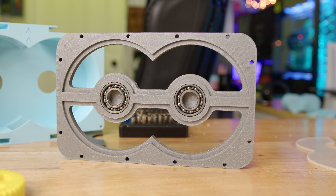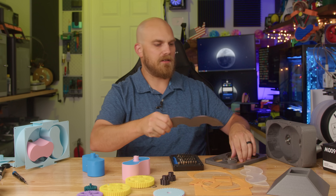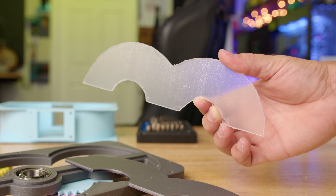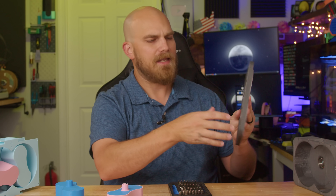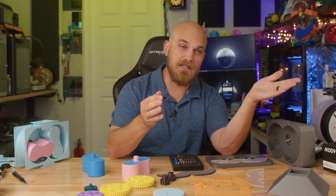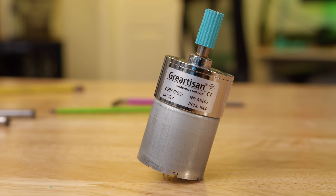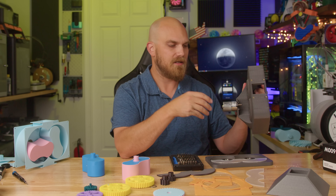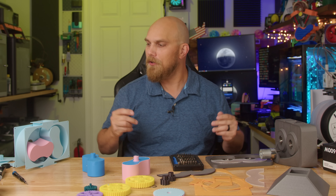First change is on the front cover — I added windows. The windows have no purpose other than, well, you know why we put windows. To make them, I drew them up, made a template, traced it onto some one-eighth inch acrylic, and just used a Dremel to cut it out. The edges are pretty rough, but they're going to snap onto the inside and they've got a border to make it look cleaner. We'll probably use some hot glue around the edges to seal it up. We also needed to tackle the power plant since the A12X25 was out. I have the T30, which is a little stronger, but PC fans aren't really known for their torque. What I did have sitting around was this little geared fan. This fan spins at 1000 RPM — just short of our 2000 RPM goal — but it is geared, so it'll have more torque. We can gear it up to get to an initial speed of 2000 and then cross our fingers and hope the lobes are somewhere over 1000. For the gear train, it's pretty simple: we have the drive gear for the motor and a one-to-two gear ratio, so every time the motor spins once, it will spin the lobe gears twice.